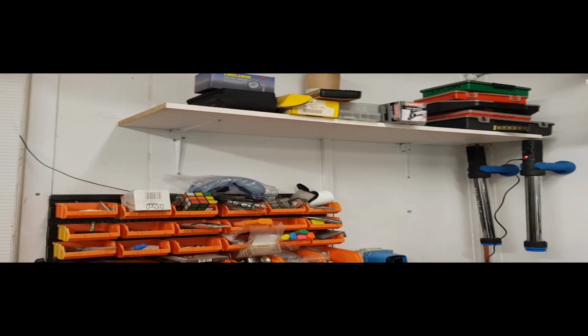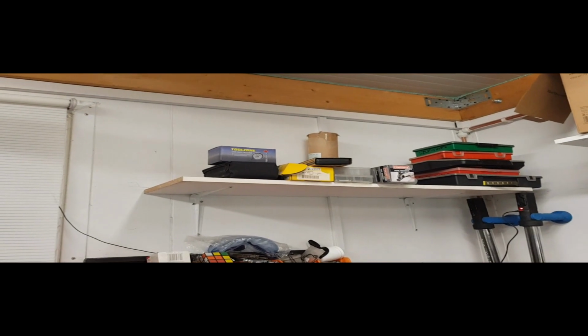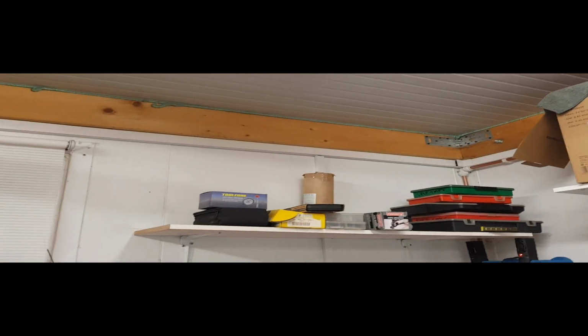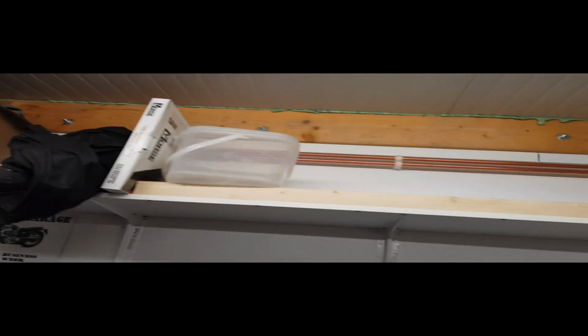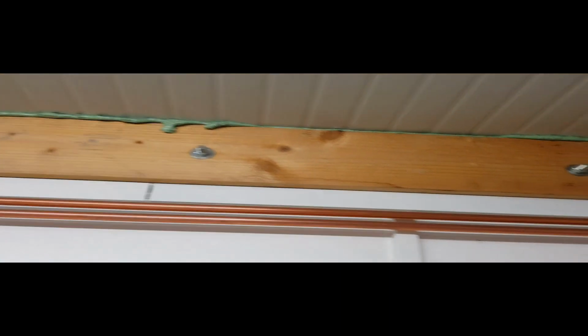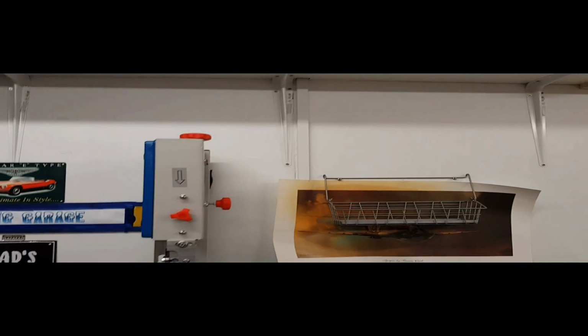Basically these panels are about 1100 millimeters wide and they're as high as you want them. I got these cut to the size I wanted, and obviously I wanted to stay within building regs for height, so 2.4 meters. I ran a perimeter all the way around of 6x2 timbers, and you can see that they're bolted through from behind with a plate on the back, and then I bolted through, so all the panels are sandwiched together.